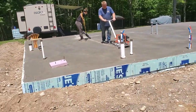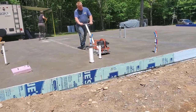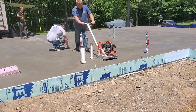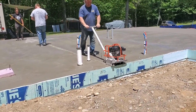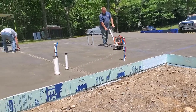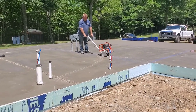It's 12:40 right now. If you remember, we started power troweling at 11 o'clock. We got done pouring the concrete at 8:30, so about four hours later we're sawing it. That's how fast this stuff dries in the summer. If you're thinking of doing this yourself, you've got to really be prepared and know what you're doing. We always saw our contraction joints in the same day — that's why we got that saw. It's a special saw for doing it green. You can saw them in the next day, but I'd do it early the next morning if I was doing that. With the Soft Cut saw, we do them the same day.